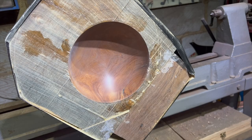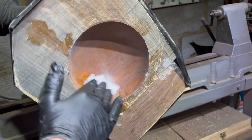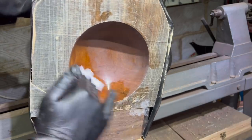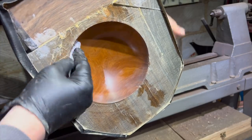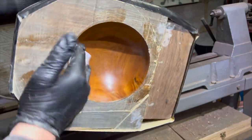I've been having serious fun with super glue and trying to fill this oily wood's gaps. Don't look too sad now with a bit of sander sealer on there. Sanded to 400 grit. Incredibly oily wood, Lignum Vitae. This bit particularly. But look at it. It's like marble.